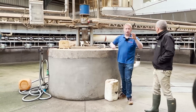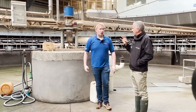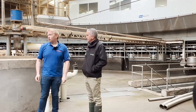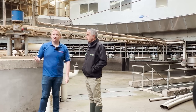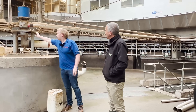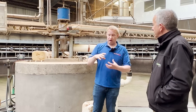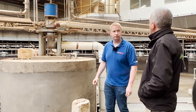The rollers run on a railway track, not an H-beam, with a double I-beam sitting on top of the rollers. They're nylon rollers — roughly two rollers per stall. This rotary has covered approximately 14,000 kilometers since it went in and we've never changed a roller, nylon or drive. There's a greasing requirement on the central pivot plate and on each drive motor bearing, but you don't oil the track itself — it's just about keeping things clamped to the track lubricated.